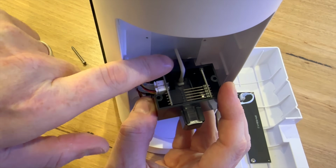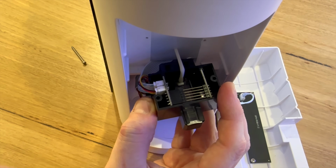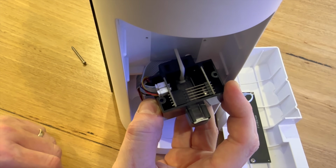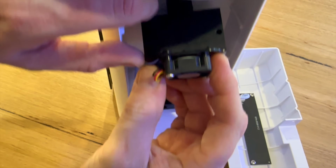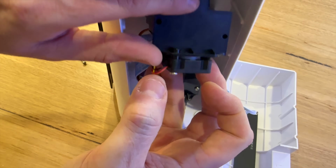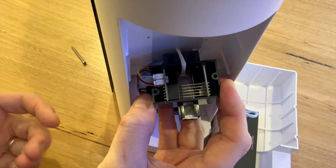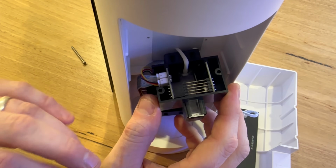All right, now that you can see, this is the line that brings, I'm kind of stretching it as far as I can there, the line that brings the water or reagent in. And then inside here, you have this little clear vial, which is the same as, say, the vial you would have on a Hanna checker, per se. There is a little magnet down there, which is controlled, if I can flip it over the other way to show you here, this little fan here has a magnet mounted on it. You can just sort of see the magnet through there. So when that fan is powered, it spins the magnet to stir the solution in there. And then you have some sensors in here, which basically look for the color change. I'm pretty sure it's a colorimeter sensor here looking for a change. There's no probes or anything like that.